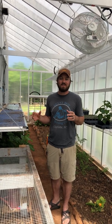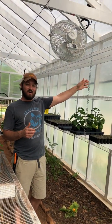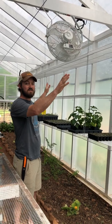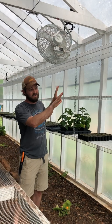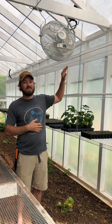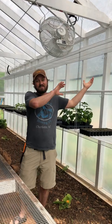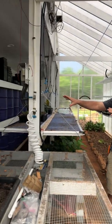So it had really good insulation value, really good heat retention capacity — so it worked. The way this thing works: this side faces due south, so we have full sun exposure on the southern sky. When the sun is low on the horizon in the winter, you get maximum sun penetration all the way up against the north wall of the greenhouse.